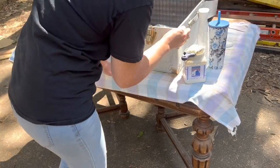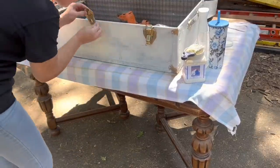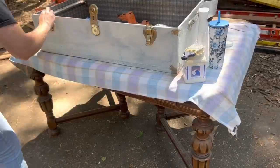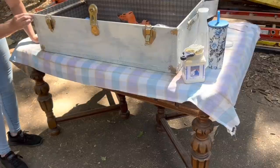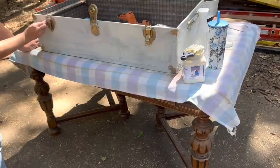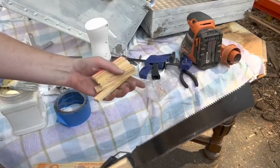To clean up the hardware, I just take a little cloth and spray it pretty heavily with water — I don't want it dripping but I want it pretty wet. Before the paint thoroughly dries, this is really easy to get off. You scrub a little bit to reactivate it and then it'll wipe right off. I don't want it all off — I want it to look like it's been on there and aged. But I do want that brighter gold to come through.